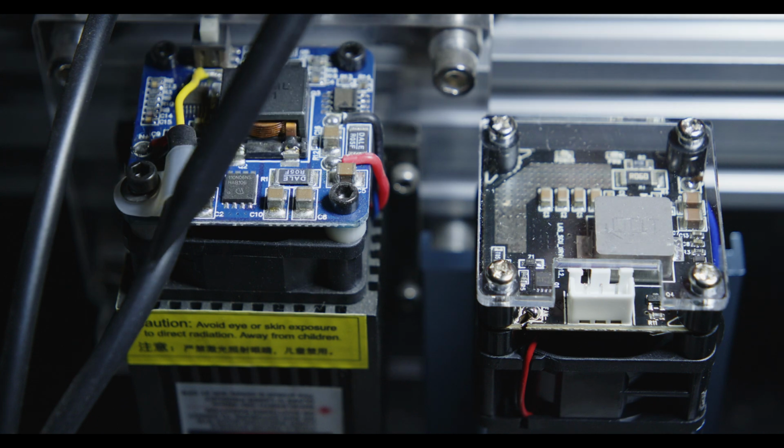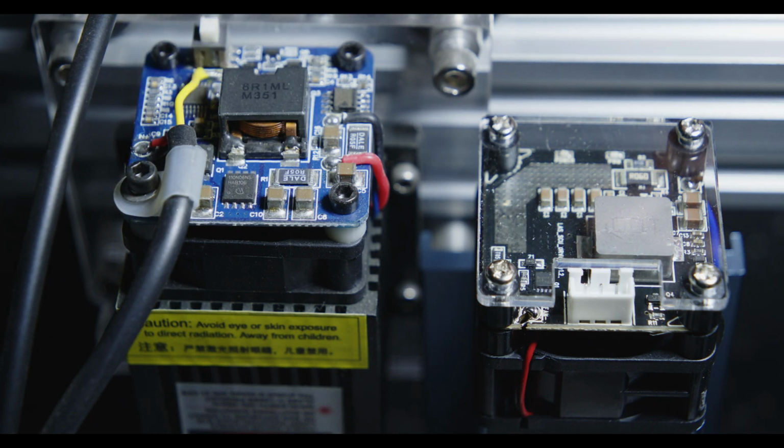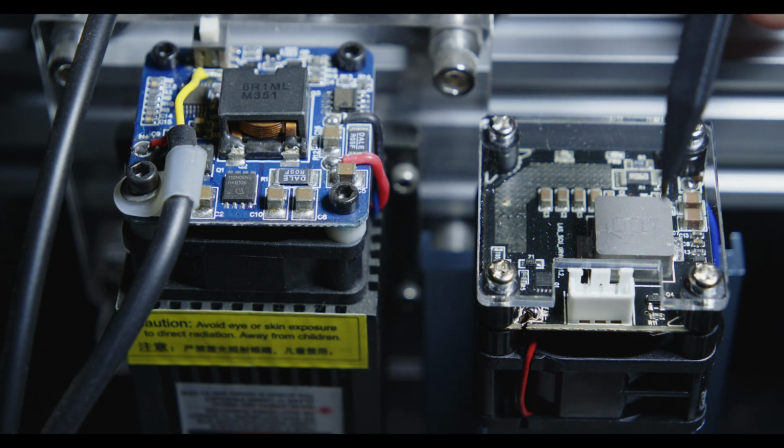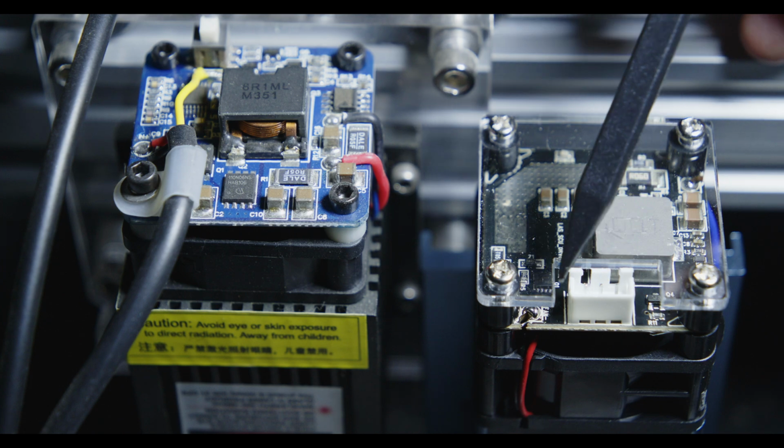We may need to make a new cable with JST connectors. Some of you may be able to do that with tooling on hand, but for the general population, I guess you would have to consider either making a JST connector to meet this, or on the other hand, desoldering this socket here and hard wiring in the unit.